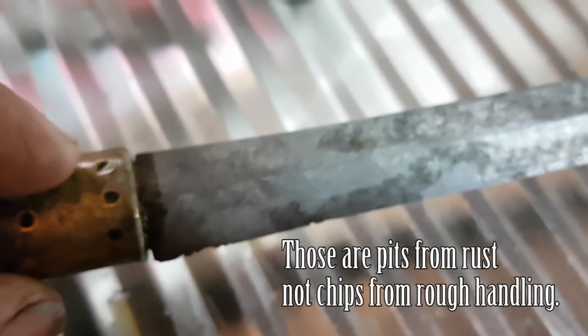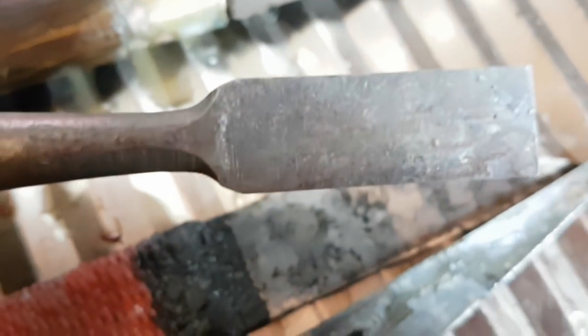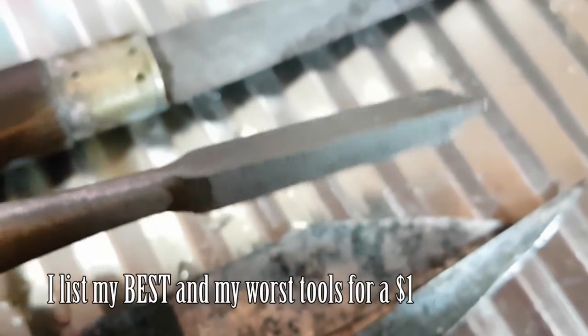In this case, that will clean up with no big deal. This is a double-beveled knife, working on both sides — those nicks in the blade will disappear very, very quickly. But if we are talking about, say, the flat of a chisel like this one — do you see how rough the back of that chisel is? It's shocking. What looked relatively smooth with the rust on, with the rust taken off through the electrolysis bath, you can now see that the pitting is pretty awful. So if I was going to sell this on eBay, I'd put it on for a dollar and just hope that I got something for it — maybe bundle it with four or five others. Look, it's still a good chisel, it'll still clean up nicely, it's just going to take a long time to get the back of that chisel flat and ready to sharpen. It's not so much that the quality of the chisel is ruined — it's that it's going to take a lot of work to restore it.